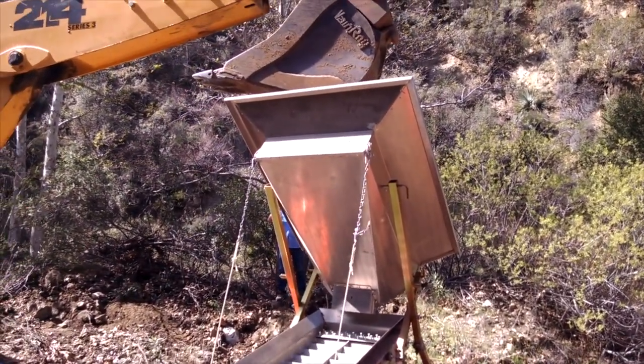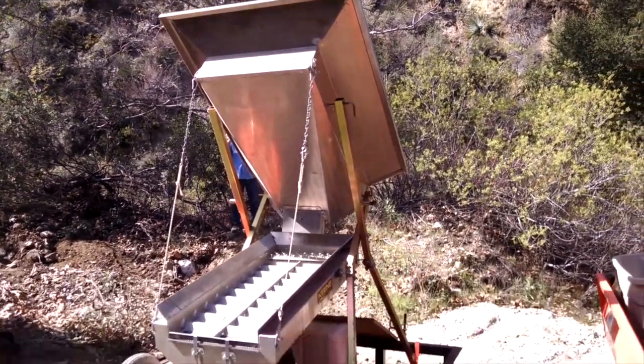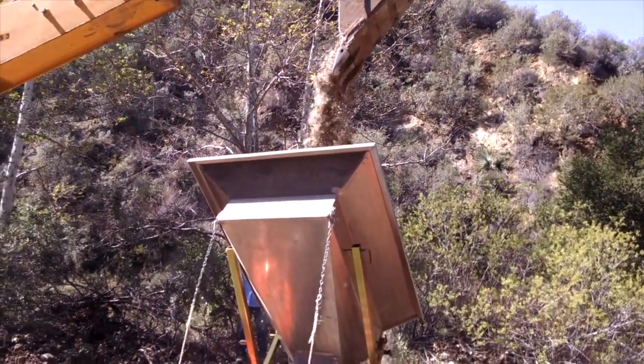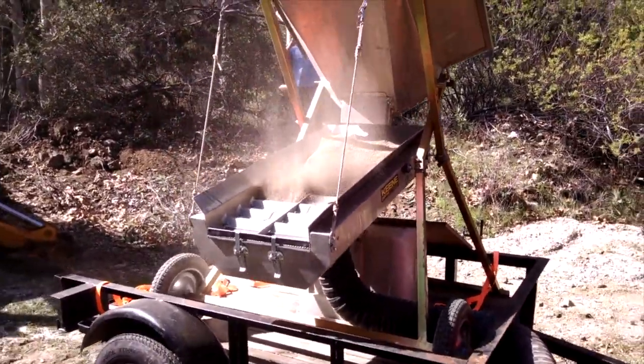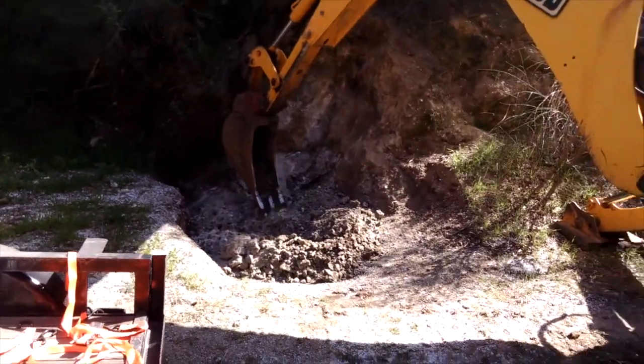This is kind of an interesting shot. You'll notice that you can tell the flow control gate is not working correctly. But you can see the material piling up on top of the scrubbing pins. The scrubbing pins really help feed the material evenly over the width of the riffle board and also help break some conglomerate rock and dirt clods. Anybody who's done any dry washing realizes the riffle board doesn't really work correctly until it's completely covered, because air is going to take the path of least resistance. So it's really important to have the whole riffle board loaded before it performs at its best.